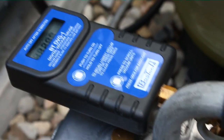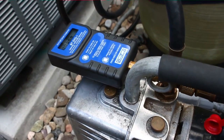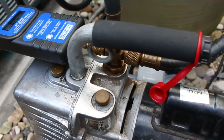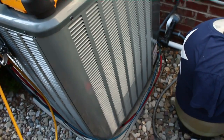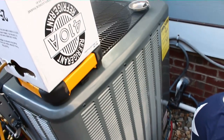Pulling a vacuum on the system. It always takes a little bit longer to pull it on a complete system after it's been running for a while — you have refrigerant trapped in oil in various parts of the system, just kind of a pain. But we'll let it run until the heart's content. Then we'll put our 17 pounds of R-410A in to start — just over 17 pounds, and probably one or two more than that for the line set.